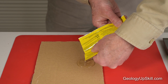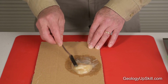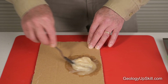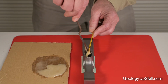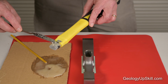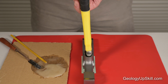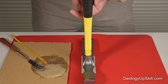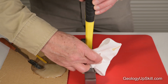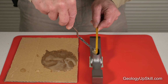You just cut the pack open with scissors, squeeze out both parts, then mix them together for a couple of minutes until the glue is a smooth, consistent, creamy colour. I filled the eye about half full with epoxy and spread some over the end of the handle to make sure all the surfaces were wetted and to fill any potential bubble gaps. Then I pushed the handle slowly in from above, wiping off the excess glue as it came out of the gaps. I used the same technique for the engineer's handle.